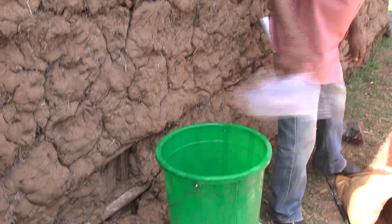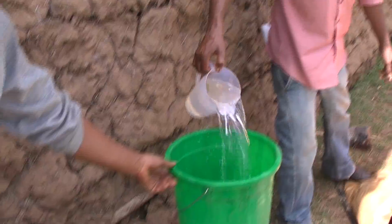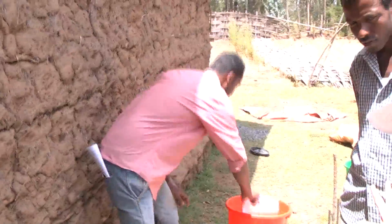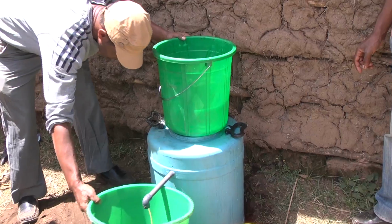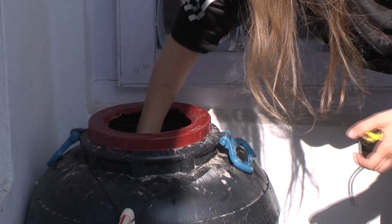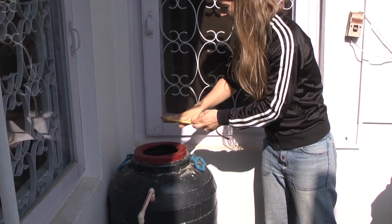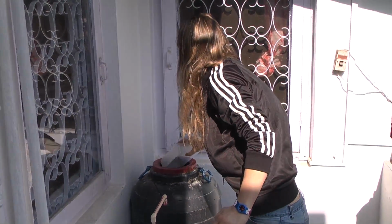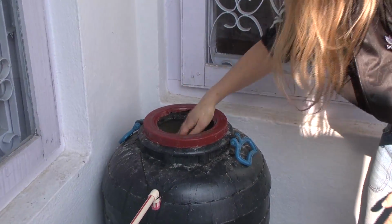At this point, we continue to add water to the tank until we find the standing water level, where water stops flowing from the tank. This should be roughly level with the PVC elbow exit to the tank. The standing water level should be 5 centimeters above the sand layer. If it is higher than this, add more sand, and if it is lower, remove sand until the appropriate level is reached. Make sure that the standing sand layer is flat once you have finished this process.